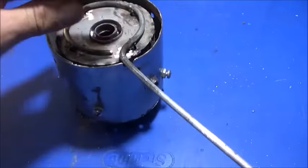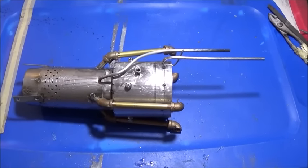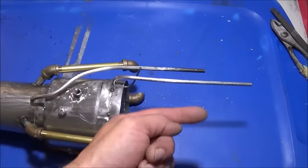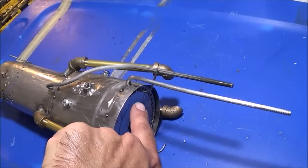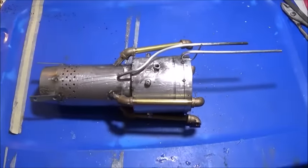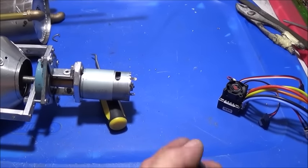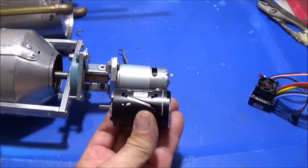We now have our fuel line, fuel atomizers, and fuel delivery tubes ready to go. Everything's installed — we've got a little notch in the case for the fuel line to come out when the lid sits down on there. We are now done with almost every bit of the construction for our turbo ramjet engine. We've finished our fuel lines and just installed the ramjet back on the turbojet engine portion — you can see the two fuel lines coming up to the front of the engine where it'll be cooler, our oil line coming up here, and the diffuser going down right behind the bushing and through the rest of our bushings through the turbojet. As a quick update at the end: we're going to replace the 20,000 RPM motor with a 50,000 RPM motor with a 60 amp motor controller — that'll be the one thing different between the construction video and the actual fire-up video. Until next time, I hope you enjoyed this — this was Mr. Teslonian.